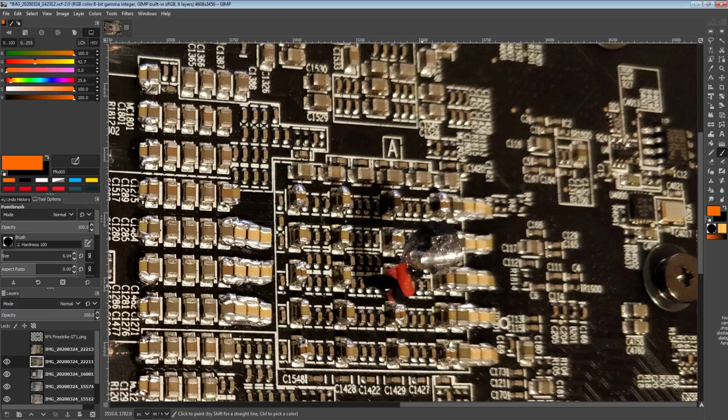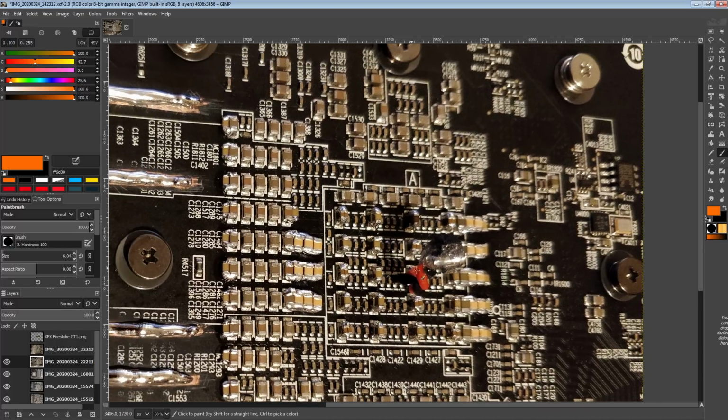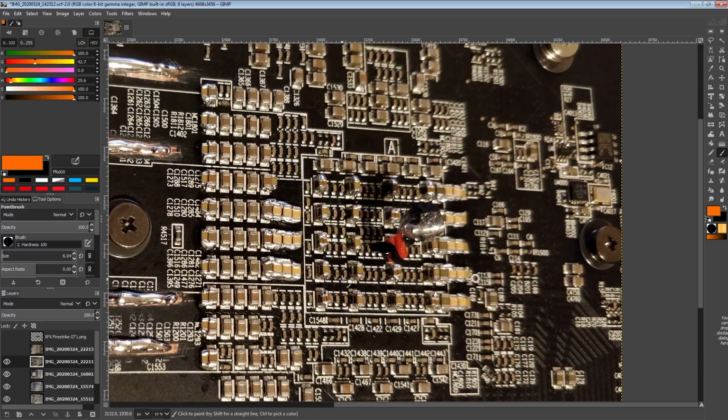I will only add capacitance around it, which already will start skewing it as well, but it shouldn't be as bad. If we were literally attaching to an extra capacitor, I think the impact would be exaggerated, and I didn't really want to do that. So for measurement's sake, I did it this way. Another way to avoid this would be to use die sense voltage readings, which would also be an option. But those are a massive pain to get because the voltage controller is on the front of the card, and I don't really like getting the wires running through the heatsink, so I didn't want to deal with that. So yeah, that's how this was hooked up.